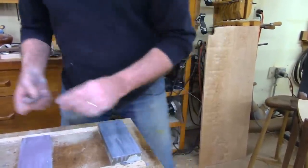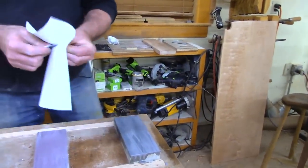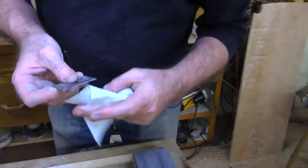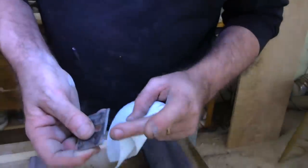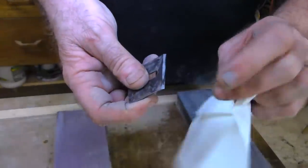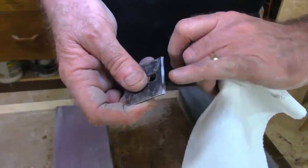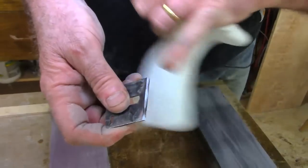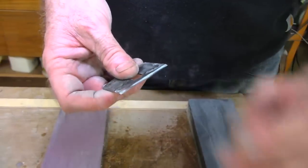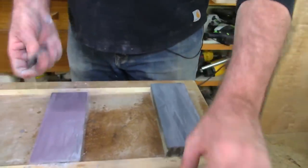You know, I'd do it a little more than that maybe, but let's see what we did. I don't think I'll be able to show you, but I can see I got a nice hone out to the end there, but it's all by hand. So the 1,000 grit looks nice and kind of satiny out near the edge, and you can see a little bit of the hollow grind. Anyway, I would then go enough there and then move to my next stone.